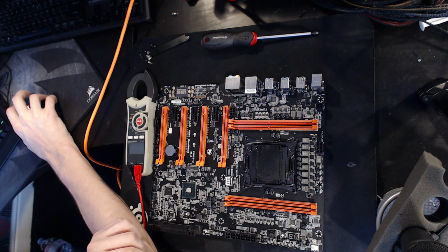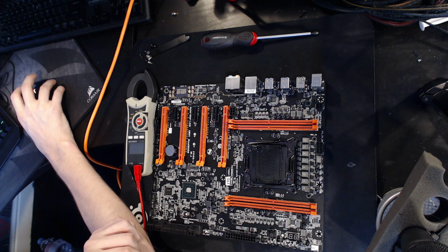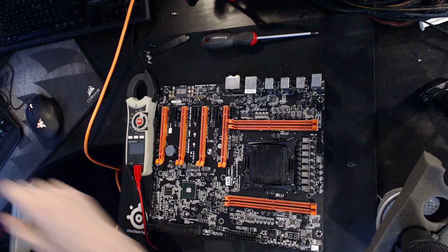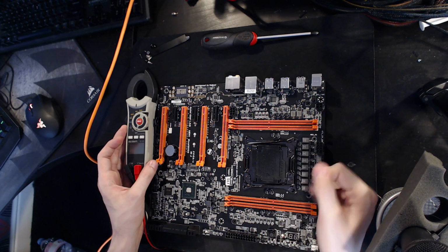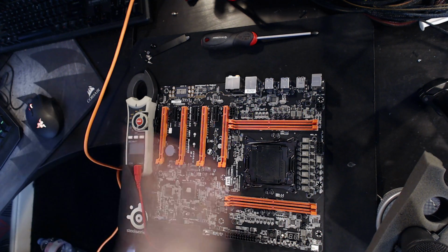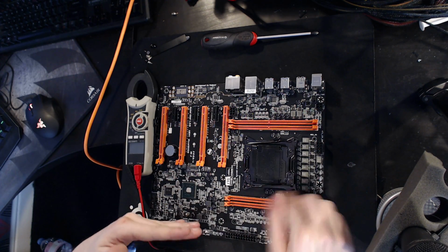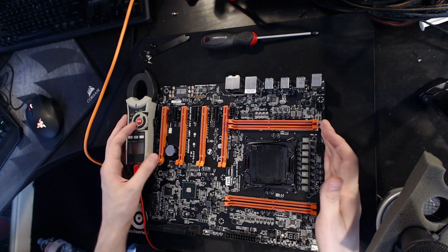200 divided by 8 is what? That's 25. At 25 amps, you're looking at about 2.5 watts, times 1.4. So you'd be looking at about 3.5 watts per power stage for 25 amps going through them at 2 volts. So that's actually really not bad. Because, you know, they're power stages, they're VRMs, basically your heat output on a VRM gets, I think it's exponential with current. Yeah, it is exponential with current.